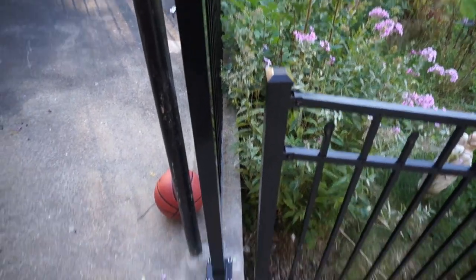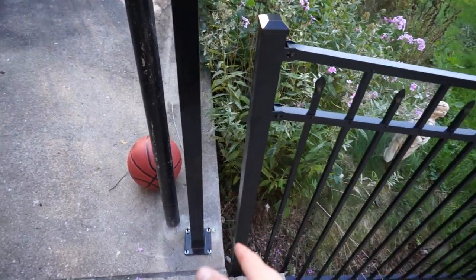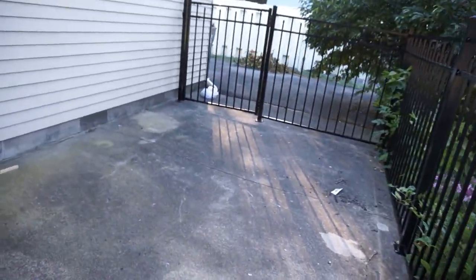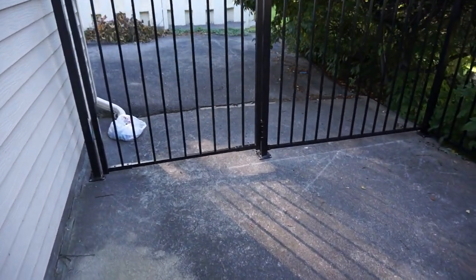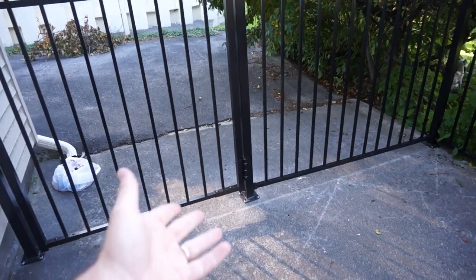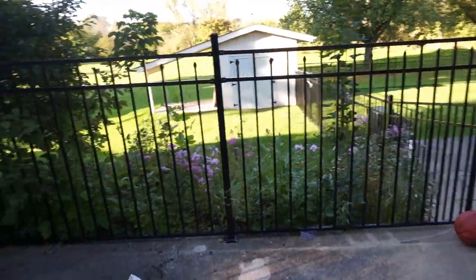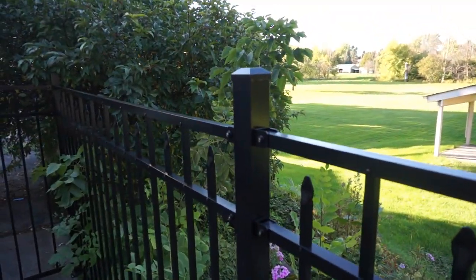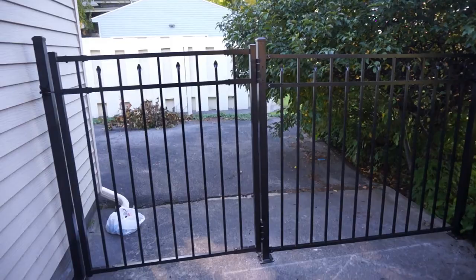Also notice the gap here — you're not supposed to go closer than two inches to the edge because you might crack it. It's actually just small enough to keep in my dogs. Over here, this part of the fence was installed over concrete using sleeve anchors, which weren't supplied but not an issue. You just drill them into the ground. The same racking and leveling issues apply here, but this fence in the concrete is much sturdier — most of the bugs have been worked out in terms of anchoring a fence to concrete.